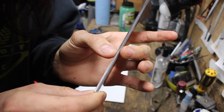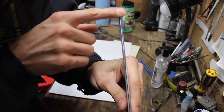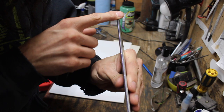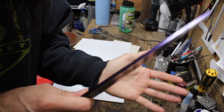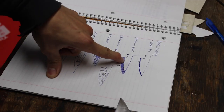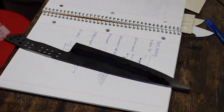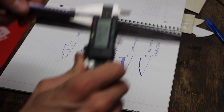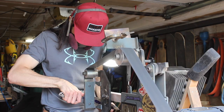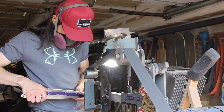I took it down to about 20 to 30 thousandths of an inch. At this point you want to make sure you have as straight a line as you can get, because you want that straight cutting edge so you know where it's going to land each time. My next step is to do the primary bevels. Since this steel is a bit thicker than what you'll probably be using — this is around 0.16 — it's going to be much thinner than that when it's done.